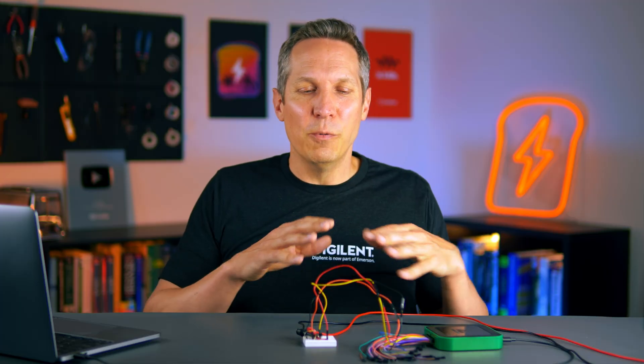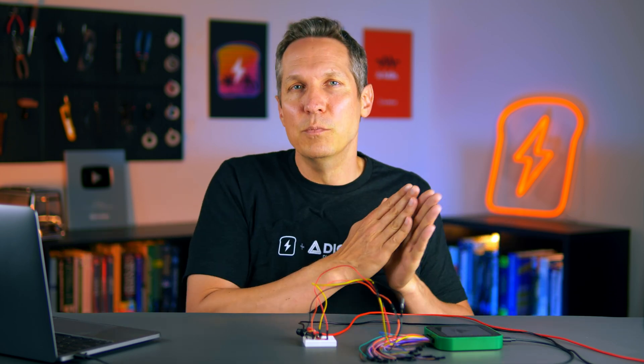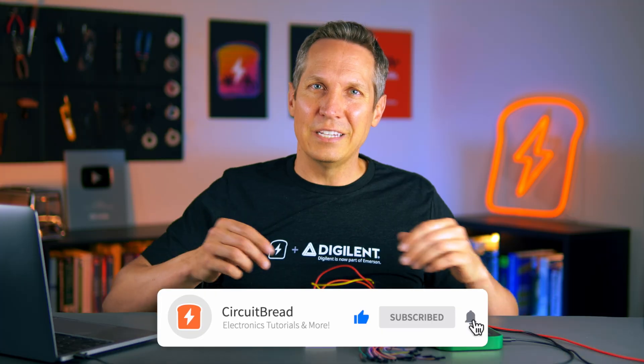I hope this has been helpful to see what's going on with the current, the loads, the voltages at different places, and how it moves through the different operating regions when you change the base. One final thing: I've been taking this from the perspective of the collector and emitter staying the same and only adjusting the base voltage. It is entirely possible to keep the base voltage the same and change the collector voltage instead, and it will move through these operating regions differently. That's easy to get confused about, so keep in mind which terminal you're adjusting. I hope you found this interesting and useful — if you did, give it a like, subscribe to our channel, and we'll catch you in the next one. Have a great day.